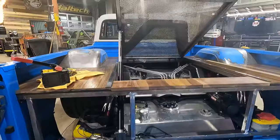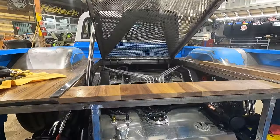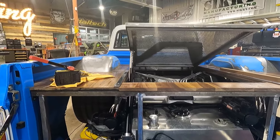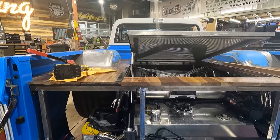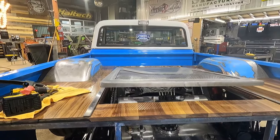All right, so my first attempt on where I laid my bracket on the upper mount, as you see, didn't work. When I shut the door where it was at, it didn't go down all the way. So what I did was I closed the actuator completely, shut the door, and then I marked my upper mount and re-pop-riveted it on. So now the door shuts all the way.